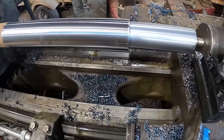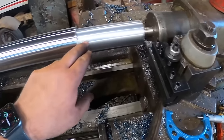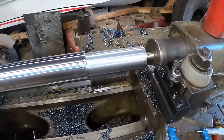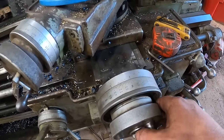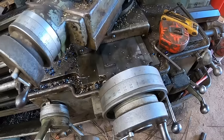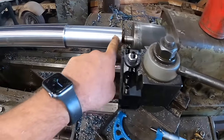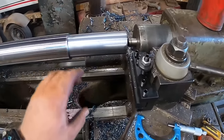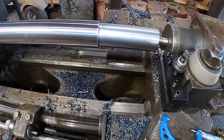That is kind of tight to go on. There is exactly 100 thousandths to take off before we get to that size. And I'm going to be real smart aleck here. That's why I hadn't pulled my machine out. We're going to run the machine forward exactly 100 thousandths, or actually about 98, and take off cutting, and when we get about here I'll stop the machine to measure it, and if it's going to be right on, I'll just go ahead and take the finish cut with the rough cut there and we'll call it good.